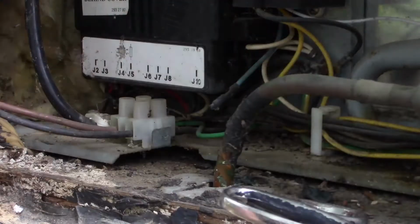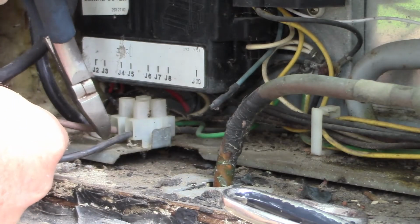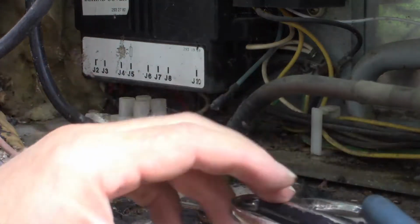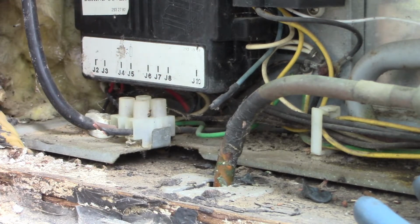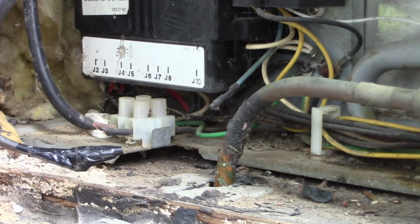That's good. Another thing we need to do is to disconnect this 12-volt supply. This black one is the negative or the ground, so I'm just going to cut the positive and we'll put a wire nut on top of it. And the negative, and we'll wrap it up with a little bit of tape. Okay, good. So we've made all our disconnects, 110, 12 volts, and propane. So that's good. Now you've got to figure out how to push it forward and in. Not sure if it's screwed down in any other place here. I'll look into that.